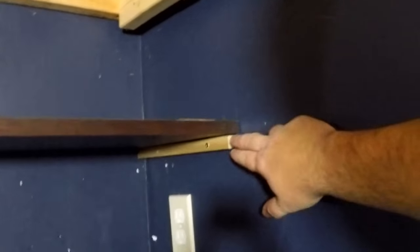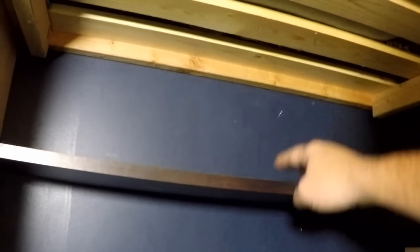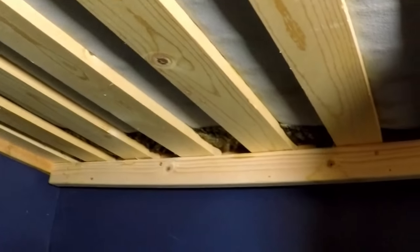The material is three-quarter inch sanded birch plywood — at Home Depot it's about $36 for a four-by-eight sheet and cuts pretty easily. The shelves are just one-inch square blocks attached to the wall at studs where possible. There's a stud in the corner, though we didn't always get lucky with stud placement, but they're pretty sturdy nonetheless. On the other side they're attached to the plywood on the outside. The shelves are one foot deep; we tried for one foot height but didn't have quite enough headspace, so the middle is one foot and the top and bottom are slightly less. The climbing rocks from Home Depot — surprisingly expensive — are fastened on the outside for them to climb up.